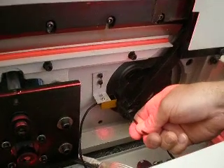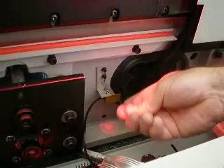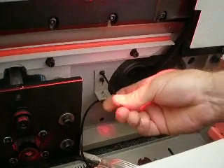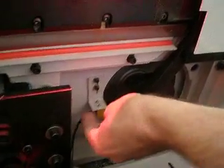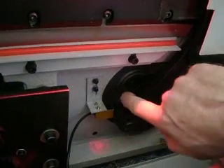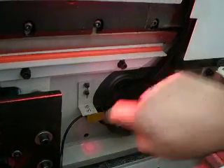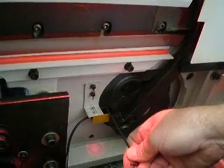This sensor needs to be about a sixteenth of an inch away from this edge of the wheel. If it's too far away, you need to loosen these two Allen wrench bolts here. When those are slightly loose, you can push this whole thing towards the wheel to where it's just barely away from it — about a sixteenth of an inch away from the edge of this black box to the edge of this wheel here.